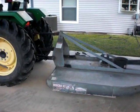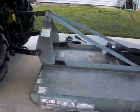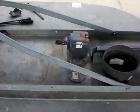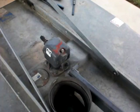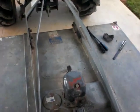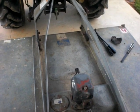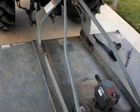Well, I went to do a little brush hogging this morning and wasn't very successful at it. The brush hog didn't seem to want to act right, so I thought maybe the blades were folded back and took a little look — the clutch is fried on it.